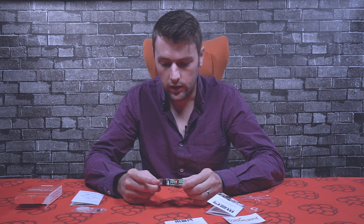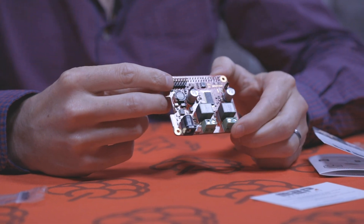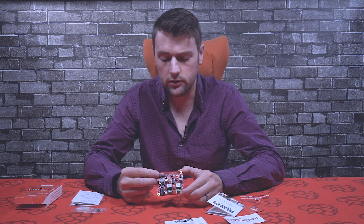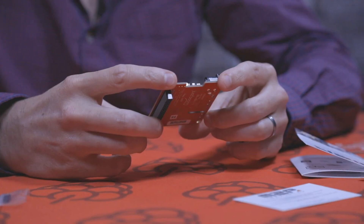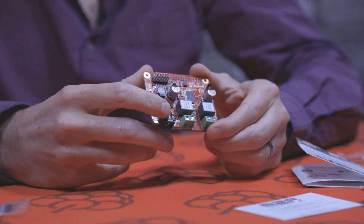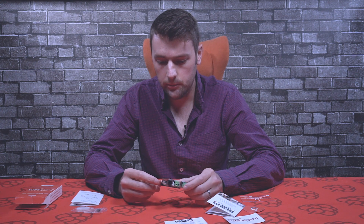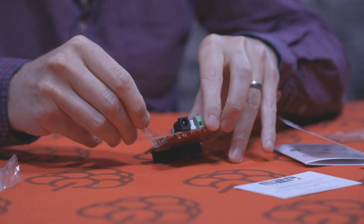You can see you've got your left and right speaker terminals. We've also got a small breakout header here — this breaks out the 5-volt, 3-volt, ground, and some GPIO pins, including I2C and UART. The TI chip used is the TAS5756M — a DAC and AMP chip combined. We also provide a 2-pin connector if you have another power supply, and the IR receiver just slots onto the end of the board.